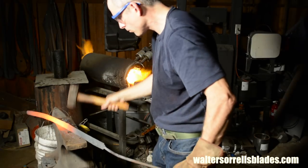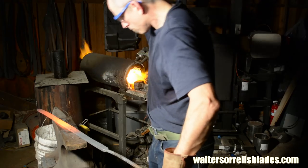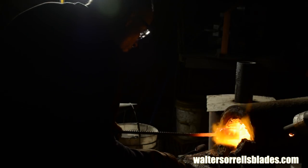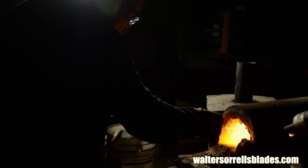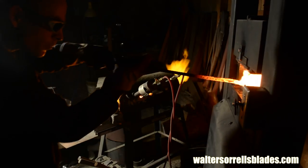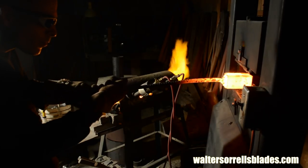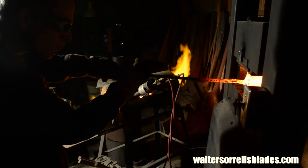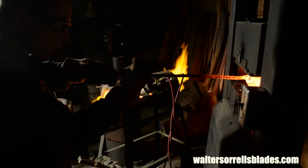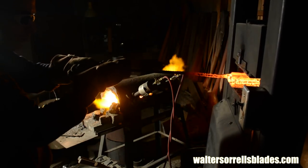This project assumes you've already made some knives and are now moving on to forging your own steel. You'll need an anvil and a forge capable of reaching around 2400 to 2500°F, or around 1350°C. The other key piece of equipment you really can't do without is some kind of power squashing equipment. Back in the day, a master smith had a couple of burly apprentices thrashing away with 20-pound sledgehammers, but today smiths use power hammers or forge presses. One of the big rookie mistakes is trying to make Damascus without the right equipment.